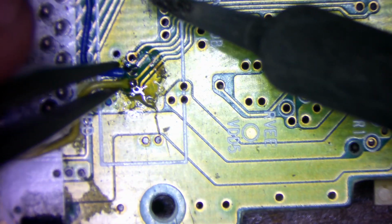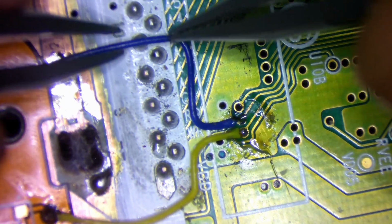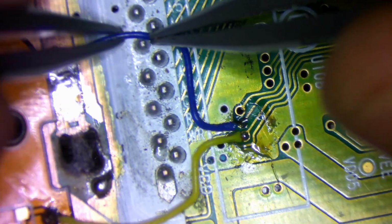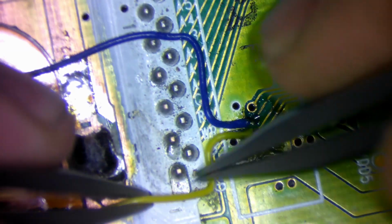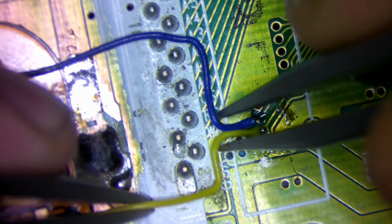The 4 wires from the button pads will be soldered to these 4 vias. I'm not using the D-pad, so I won't have to worry about that. You can check out Froggo Custom's Instagram to see where the D-pad wires can go, and also to give you some sort of visual representation as to where the other wires should go as well.